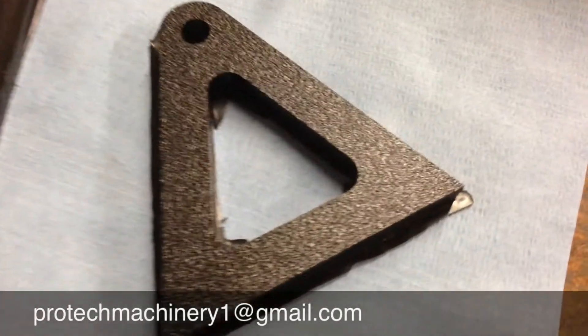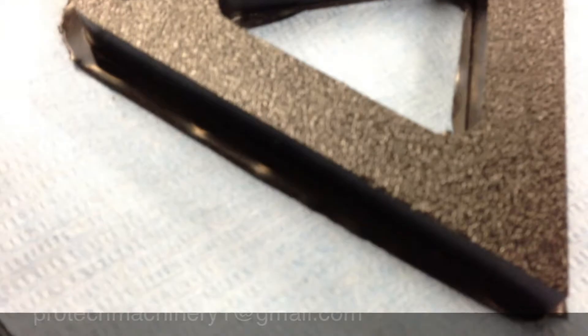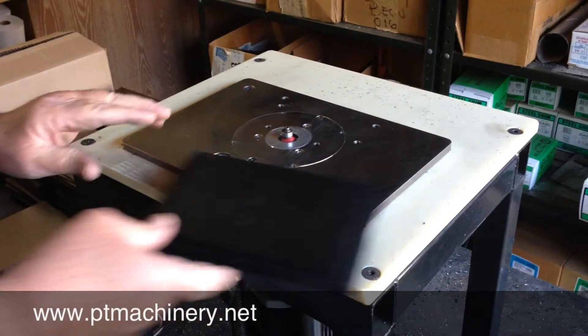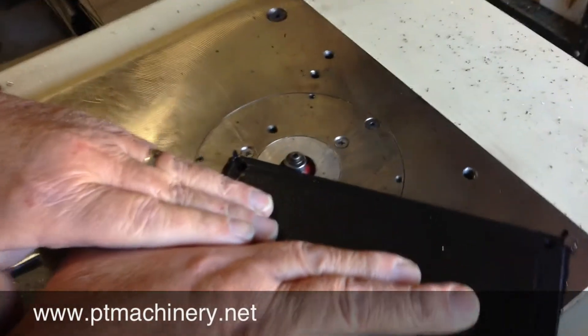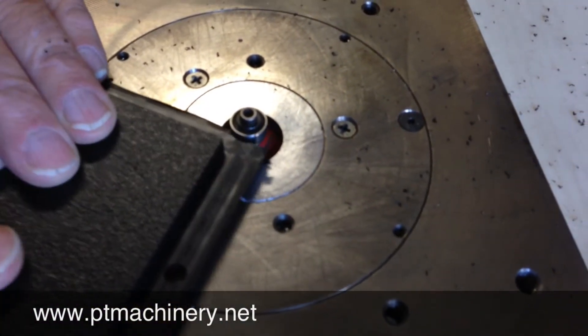Here are some relatively small plastic parts that we cut on a CNC router. To ensure that they would not move, we left them attached to the sheet with a small 10 to 30 thousandths skin. That skin is going to be easily removed when we move over to the trimming router table. Here we can easily take off that skin and also put a radius or a beveled edge onto the top or bottom of the part. It's easily done in a matter of seconds.